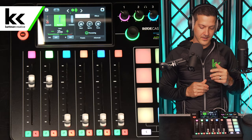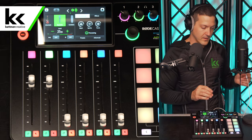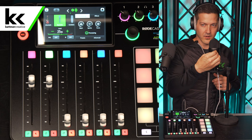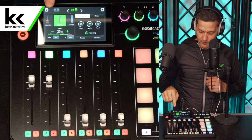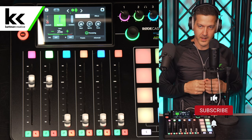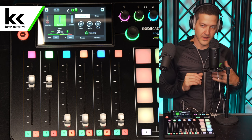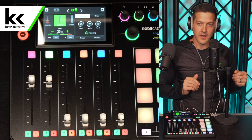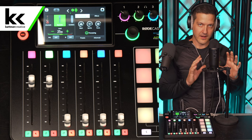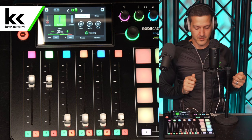I'm going to move over to the Blue Yeti now — you're going to hear how it sounds as I set the gain and adjust everything. Right now you can see that my gain is turned pretty much all the way down, but if we look over at the Rode Rodecaster, my level is right in the sweet spot — right in that green band, which is exactly where you want to be. The headphone volume on the front of this microphone is at 50%. The reason you don't want to go higher than 50% with the headphone output is that headphone outputs are really noisy, hissy, and gainy.